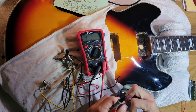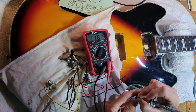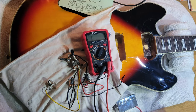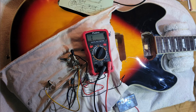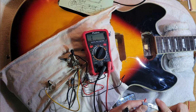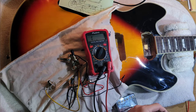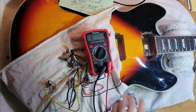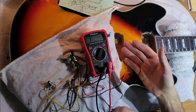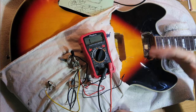One thing I'm going to do first is test the ohm ratings on these pickups. 11.67 — that's hot. They're not high-output pickups though, they just have a lot of windings. Just because it reads high doesn't necessarily tell the whole tale. That's 11.46. You usually put the hotter pickup in the bridge because the strings don't vibrate quite as much there.